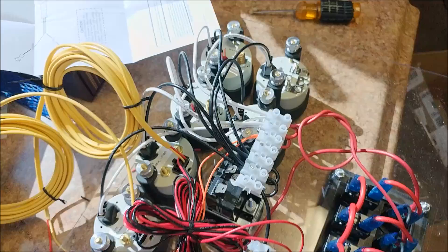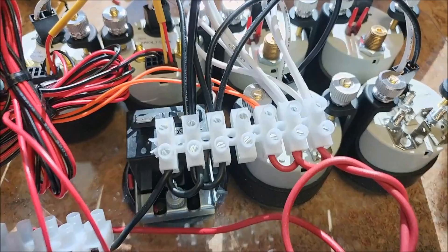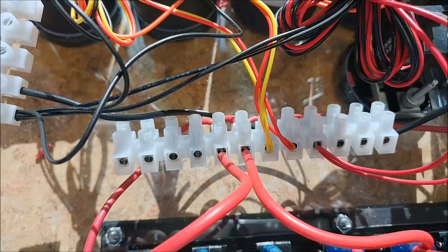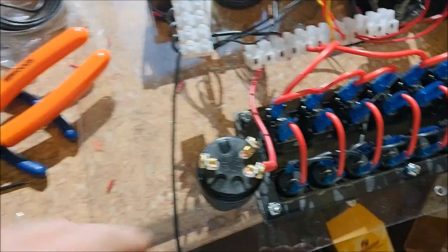There's a lot of exciting stuff happening in the next couple of weeks with the engine. I have to get the wiring sorted out for the instruments on the test stand. I'm basically in the process of wiring everything up - got a couple of little terminal blocks, creating grounds, positives, and some switched circuits. I'm going to mount those terminal blocks on a bracket later, but I just wanted them in position so I could wire everything up. Trying to keep it all neat and tidy - a lot of different wires, but it's coming together nicely.